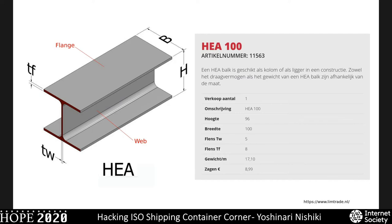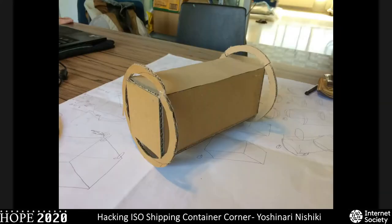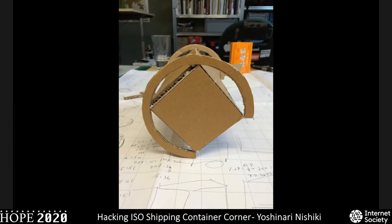FanDome had mock container corners so I could test how the connection could work. There's a bottom twist lock and a side twist lock, manually twisted to lock. An interesting thing I found: the side twist lock that functions completely manually actually costs more than €100 per piece — way more expensive than the bottom twist lock with a lever at roughly €20. I had to buy eight of those. The bottom twist lock needed a foundation structure welded to steel — my architect friend Frank Law suggested the basic H-beam, which is strong enough not to collapse under a container.